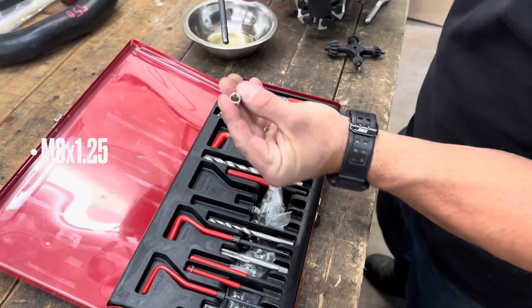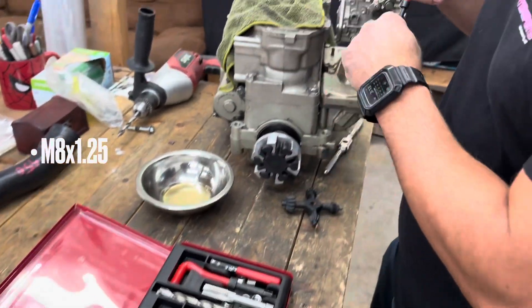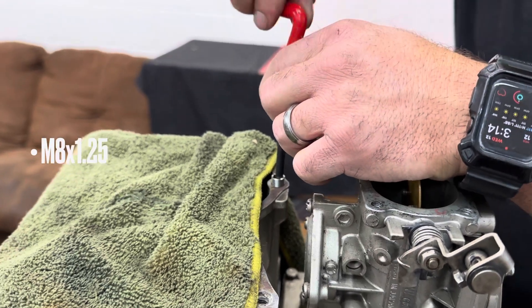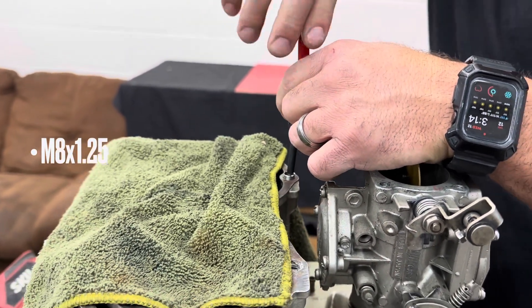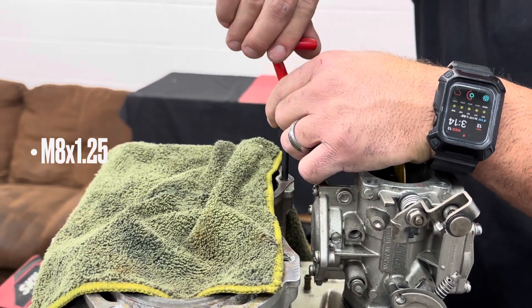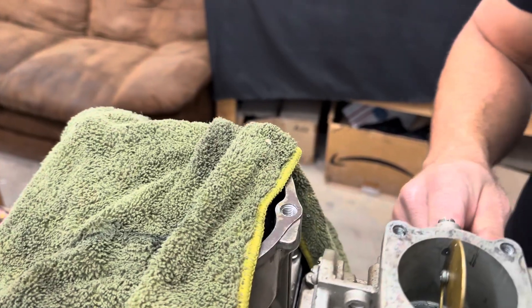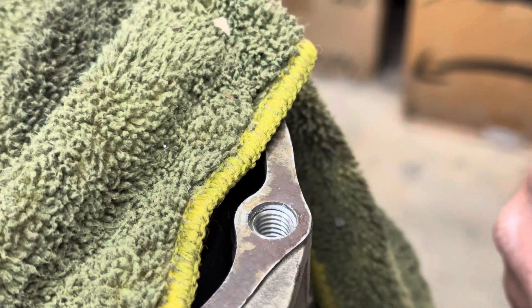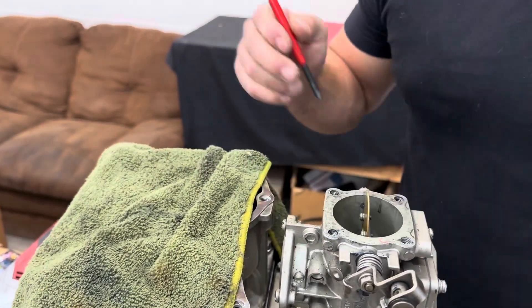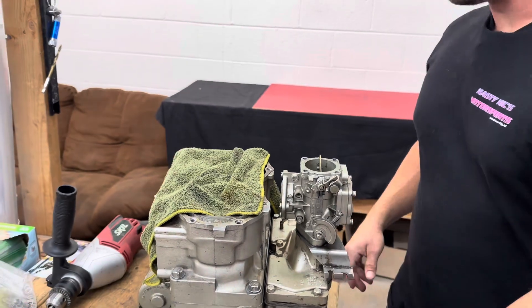This is the tool you're going to use. Take the inside of the coil and insert this into the tab so it locks in. Put it nice and steady and straight, and turn it in gently — you can see it just rotates in real easy. Go ahead and seat that down as far as you can go. Sometimes if you drill too far and the hole is too big, you might need two coils. Once it's in nice, take this punch piece, put it in the hole, and push — that knocks out the little tab inside and locks the coil into position. Now you have new threads.